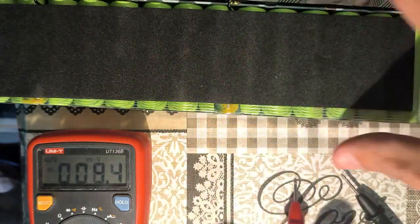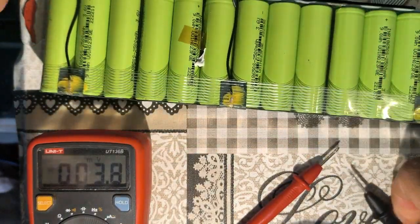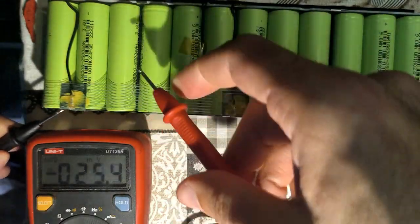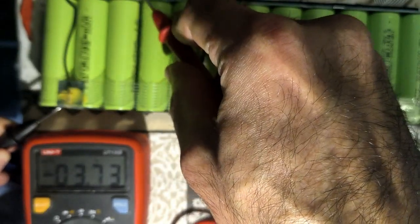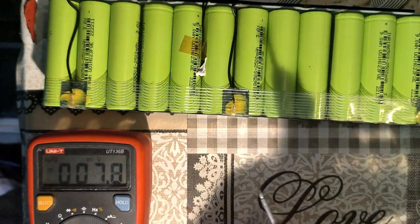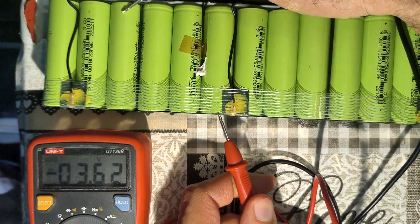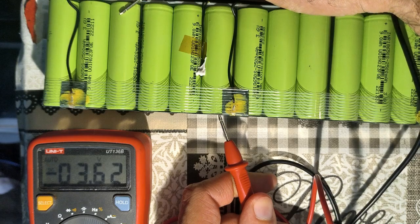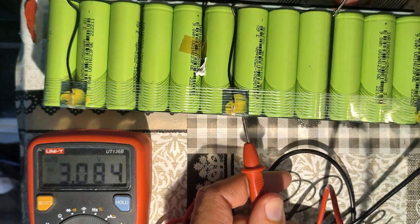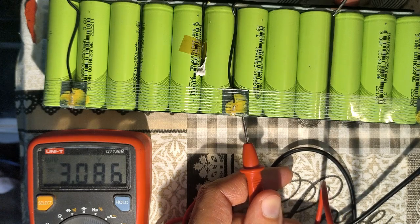3.7 — that's healthy. 3.3; we flip the battery to continue. Going from here to here: 3.7, also healthy. Now we measure from here to here: 3.6, also reasonably healthy. And let's measure from here to here — here we find 3 volts. That's the lowest voltage we've found so far.